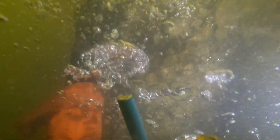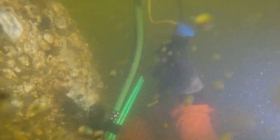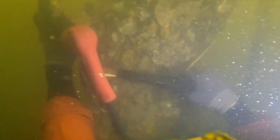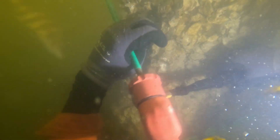When I spark this next cut, take a look at the base of the rod where it meets the torch — you can see we have an oxygen leak here. This is particularly dangerous because you could potentially have a fire that chases up the line to topside, or the torch could blow up in your hand. It's very rare because you have fail-safes like a flash arrester that will extinguish any fire chasing up the line, but with that kind of leak we definitely need to change the O-ring or get the rod seated tighter next time.